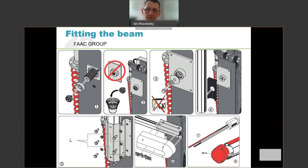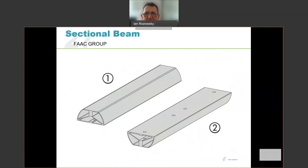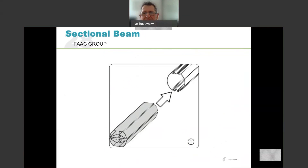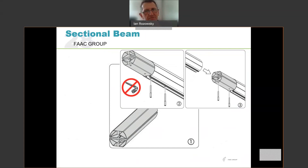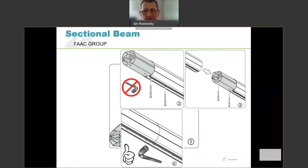Once the beam is fitted, lower the boom and fit the red LED strip on the top of the boom arm — a transparent strip that covers the LED rope lights if fitted. Fit the rubber bumper strip on the underside of the boom arm; it sometimes helps to spray a little water on them first to lubricate them before pushing into the extrusion. Then cut those to length and fit the red boom end cap with the fasteners provided. If working with a sectional beam made of two parts, there will be a joiner — two parts assembled together. Slide them into the starter section of beam already fitted onto the barrier, fit fasteners hand tight, then fit the second section, fit its fasteners, and tighten everything up for a clean invisible connection.